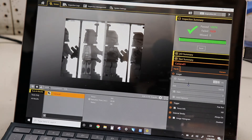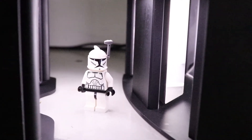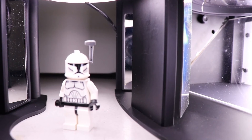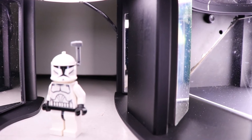There are four orthonormal views of an object provided through a bi-telecentric lens, reflected off a series of mirrors. When we look inside the lens, we can see many mirrors designed to reflect back into the imager. This allows each view to cover exactly 90 degrees with respect to its neighboring views, ensuring complete coverage of the object's lateral surface.